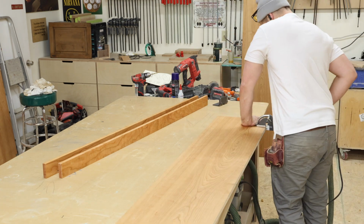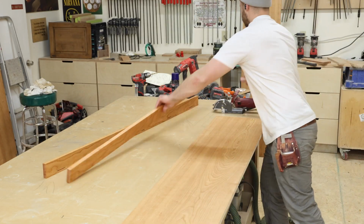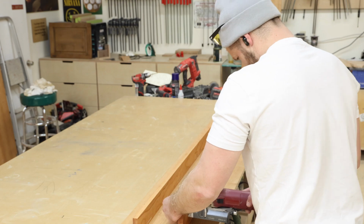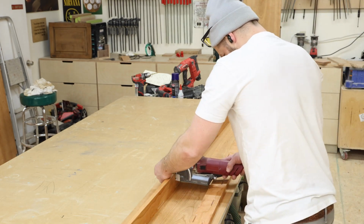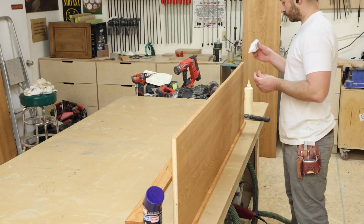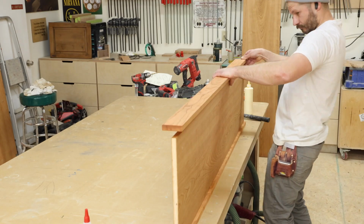And then this is our top piece. I am connecting a couple rails that go across the front and the back. We need to have a 1/2 inch offset, and I'm using regular biscuits because I'm out of Tensos for my other Lamello. If you need a Lamello, hit me up and I'll hook you up with a sales rep. But yeah, so I just used some regular biscuits, yellow glue, and some CA glue to hold it until that yellow glue dries.